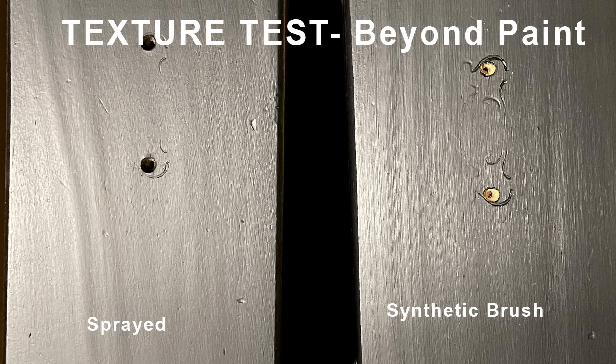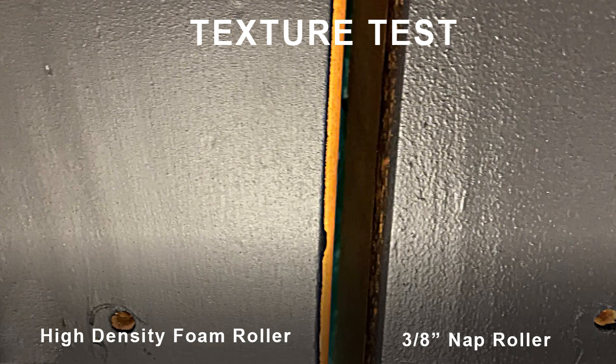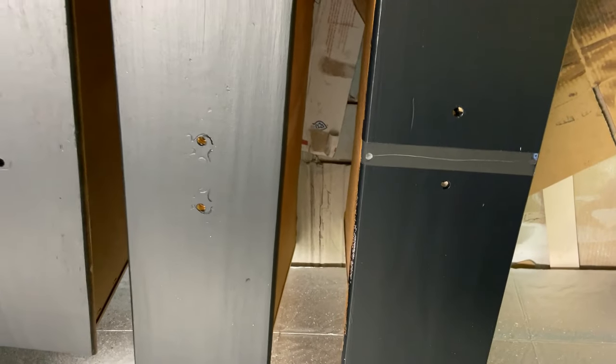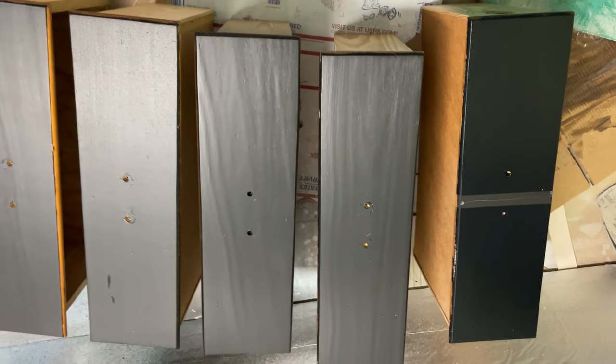The sprayed sample of Beyond Paint appeared to look about the same as the brushed sample. However, the texture seen on the sprayed sample appeared to be the wood grain, not the paint texture. Here you can see the Beyond Paint applied with a high-density foam roller on the left and a 3/8-inch nap roller on the right. The nap roller left a lot of texture on the surface that could easily be seen and felt. Only a little texture remained with the foam roller. The sample applied with the foam roller appears to need a third coat of Beyond Paint, whereas the other samples didn't appear to need any further coats. If the final painted texture on your furniture is important to you, this information should help in selecting the preferred paint and application technique.